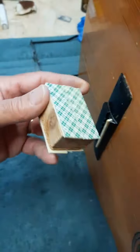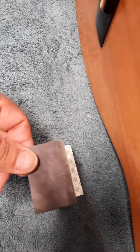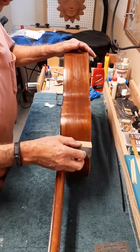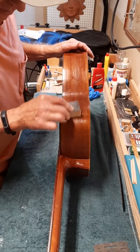The next step is to knock off that little bit of roughness with some 1,500 grit sandpaper. The way I do it is I put some double-sided tape on there, pull that off, apply the 1,500 grit to the top of that, and just go over everything real lightly so it feels fairly smooth. Then we'll put the second coat on, which is going to darken it a little bit more — which is okay because it's that red color I'm after. You can hear and feel just how light I'm going, and it'll dull it a little bit, which is okay.